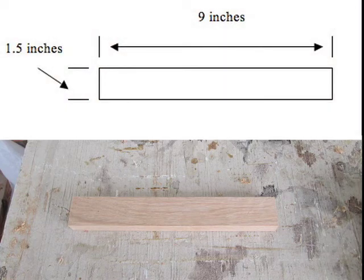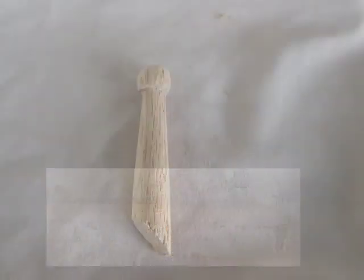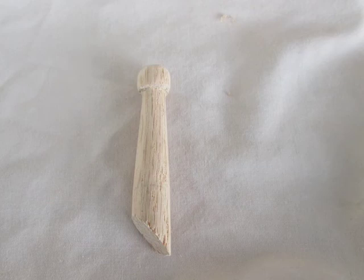I cut a nine inch length for the back, since I plan to only mount two hooks. The hooks were made from some leftover half-inch doweling, and when done would measure two and a quarter inches in length. I could have just cut the doweling to length and rounded the ends, but I decided to do a little fancy work with a spokeshave and make a bowling pin type of design. I figured that would provide a better grip for clothing and the straps on the face masks.